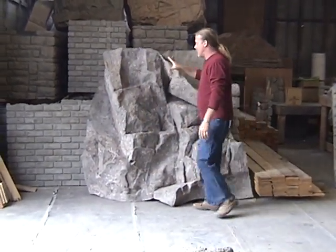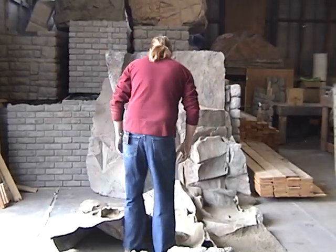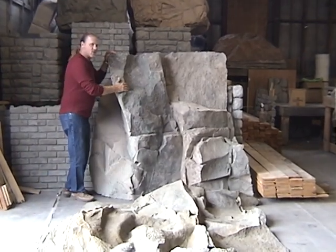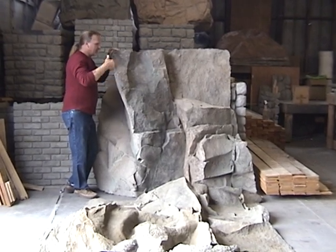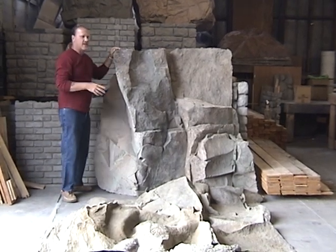With this just being laid back on, it's not going to replicate the exact form, shape, and texture. So when you're doing a cast, go ahead and put your rubber on, let it dry, then put your hard mold over it — segment where you need to — and then once that dries, de-mold it and pull it off. Now you've got true form, true texture, exact replication of what you took out in nature.